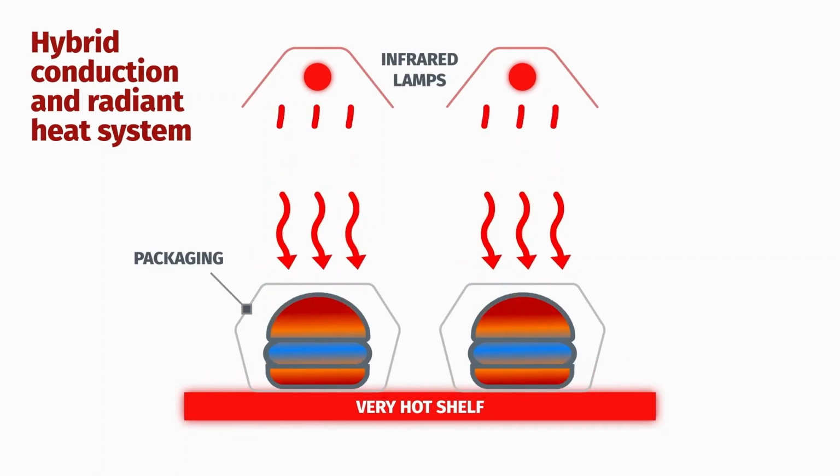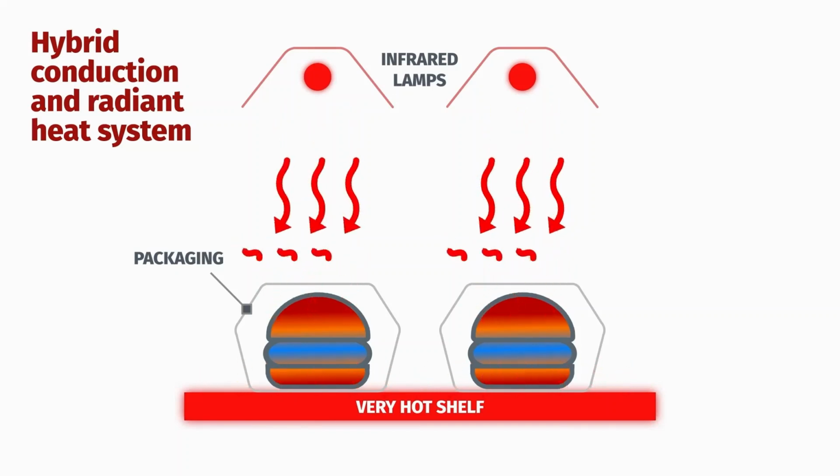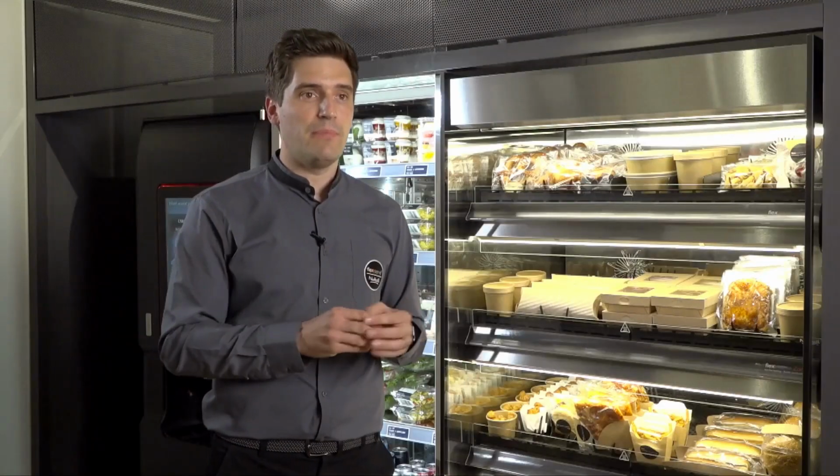This causes quality issues throughout the product. The top and bottom of the bun and the protein, which is the most important thing to keep hot, may actually be below temperature. With these methods, food quality suffers because product temperatures are not consistent throughout. Even in units with supplementary air, the situation is not significantly improved, and ultimately they are not comparable to a true convection system.